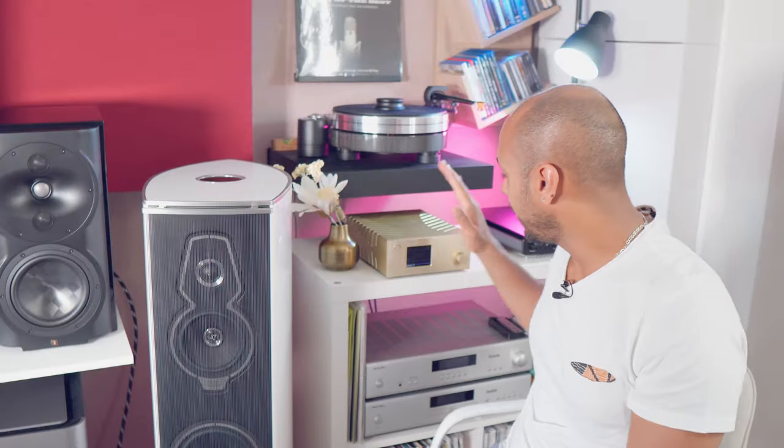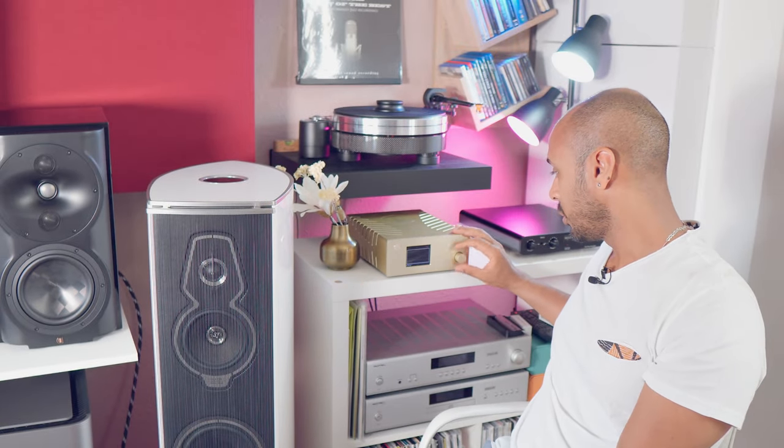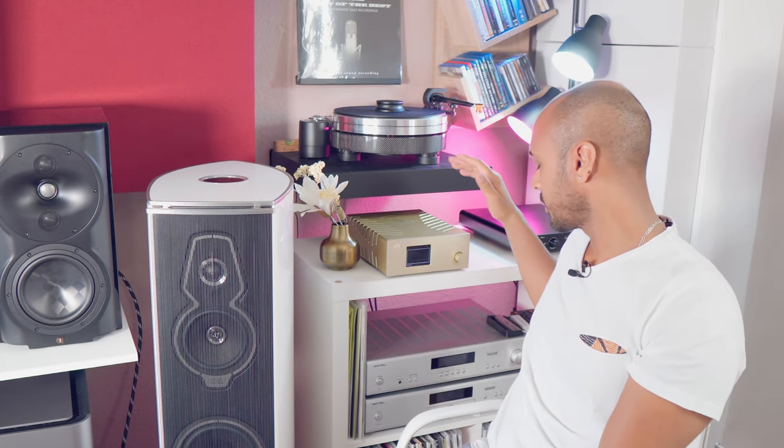Moving magnet has a fixed capacitance load of 220 picofarad, if I'm not wrong. It's not possible to change it and it should be fine with most moving magnet cartridges, so absolutely no problem. And in the end we have the 6 equalization curves. That's probably the most beautiful part of the PH-10, something really unique.